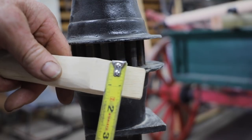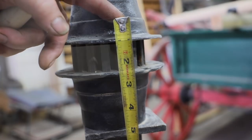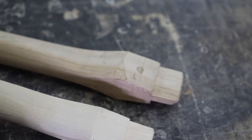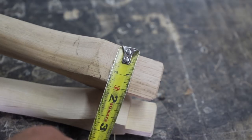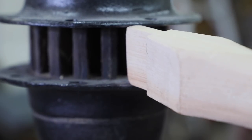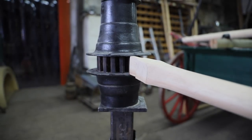This is the 1¼. And when I try to fit it into the second set of hubs, it's just too small. The second set is designed for 1⅜ spoke. Well, with 1⅜, the wedge is wider than the 1¼. So I have to modify these 1⅜ in thickness of the wedge down to the same thickness as 1¼, while remaining 1⅜ through the main head of the spoke.